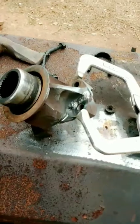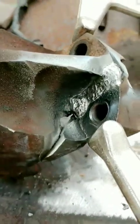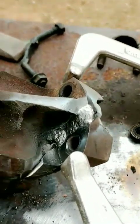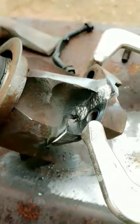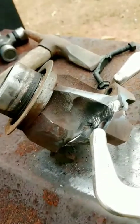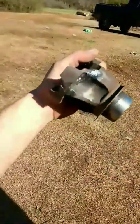Yes. First pass is in place on the back side. When you're welding that thing, you want to shove that nickel rod down into there and then peen it. Don't try to weld all of it at one time. Keep your temperature at a minimum, because once you get cast iron too hot, it just turns into a pound cake. What I mean by you don't want to get it too hot is you want to be able to pick it up about 10 minutes after welding.